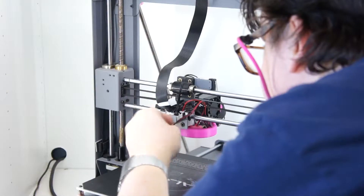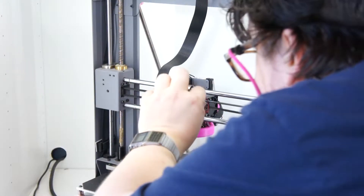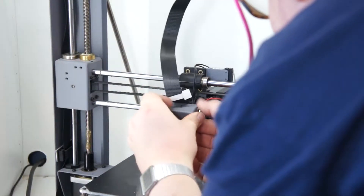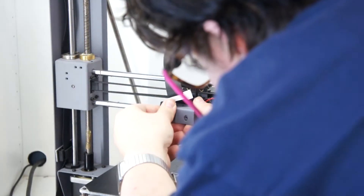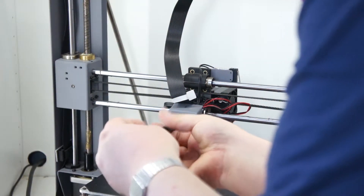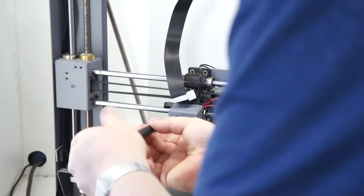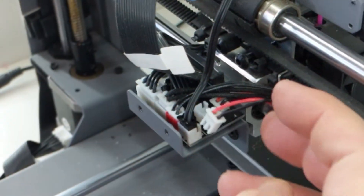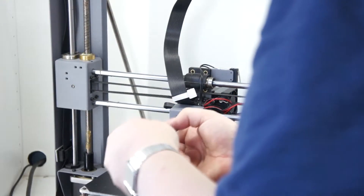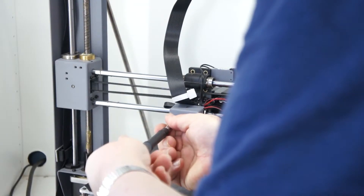See the other video for details on that, then plug everything in at the back. Finally, using the two screws, reattach the plate that covers the little control board at the back. Incidentally, while doing this mod I also swapped out the hot end cooling fan for a replacement, as it was starting to make a noise. That's just the little plug in front of the black plug — if you want to do that yourself, that's the one you need. This fan is wired the right way around so there's no need to switch any cables.